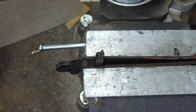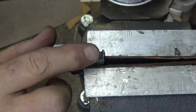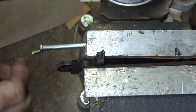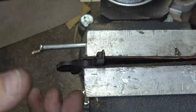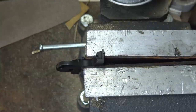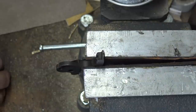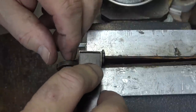These little guns tend to have a real issue with cap sucking. What that is: the hammer falls on a cap, explodes it, then pulls it back off the nipple when you cock it again. The cap drops off, falls between the hammer and the action, and when the hammer falls for your next shot it doesn't reach the cap to set it off because a piece of cap is wedged in between this and the frame. Then you can't even pull it back — it locks the whole gun up. Over the years I've had a lot of trouble with these small frame guns, especially with cap sucking. The thing that seems to work best is what I call defanging the hammer nose.